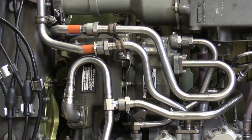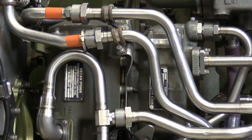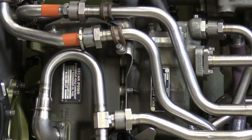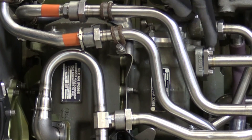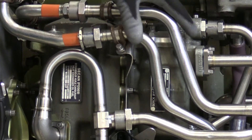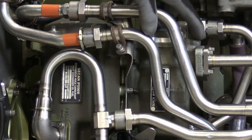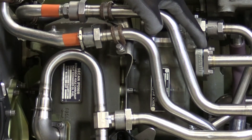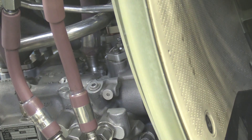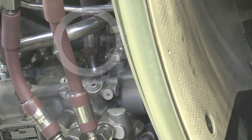For this Maintenance Minute video, I've chosen a location on the engine which is honestly a little bit easier to access for camera location. This is a servo fuel heater and oil line in manifold connection. Gasket seals are used on both oil system and fuel system components, and the installation and inspection of these components is applicable to other locations. This location on top of the hydromechanical unit, providing high pressure fuel into the HMU for the servo system, uses a gasket seal.